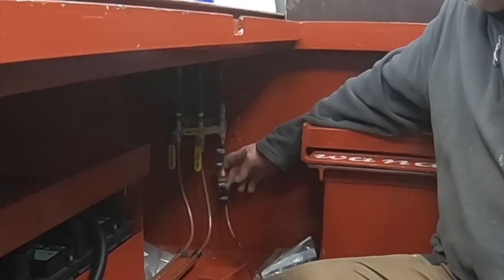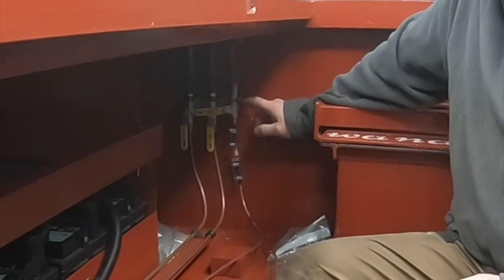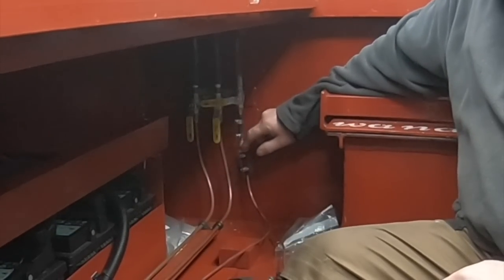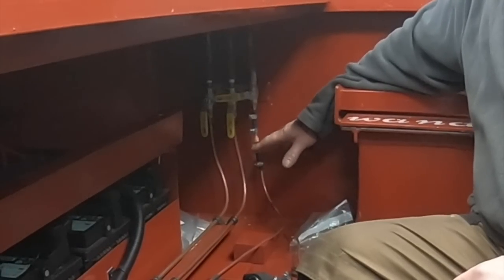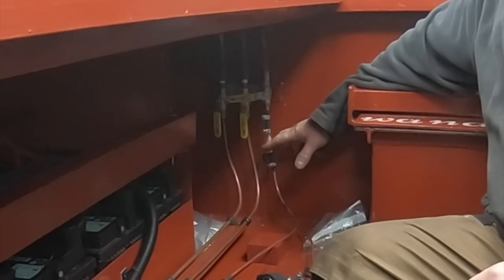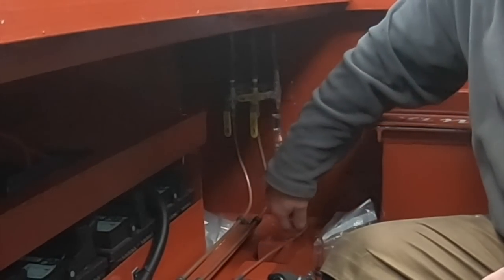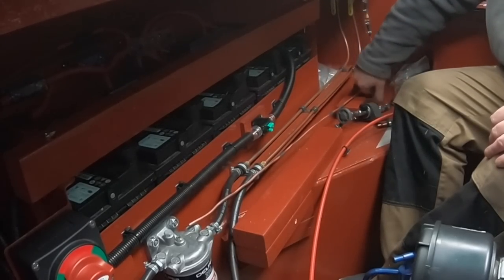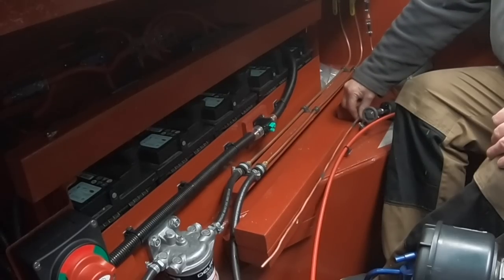Made a start on the fuel line now for the diesel heater, and we've got an auxiliary feed off the tank, so we've put a valve in the same as Ian put in for the engine, and then it drops down here, then it goes into an inline filter which sits just there. Doesn't have to be there, but ours is sitting just there. And then we've run a pipe across that's going to run in front of these here so we can secure the pipe onto there with clips. So that's going to run on the front of there,